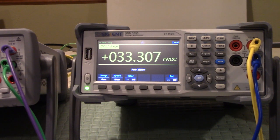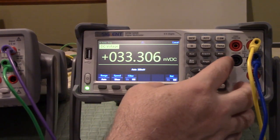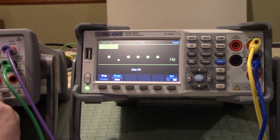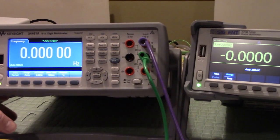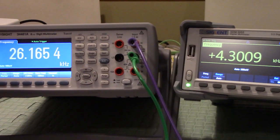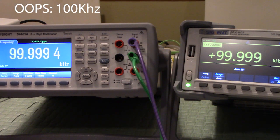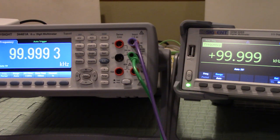The next test is the frequency test. I'm hooking this up to the Tektronix function generator set to 10 kilohertz, and both meters are reading the same — really, really good. Now the interesting part: I've done this before and it turns out that the Agilent here can only go up to about 800 kilohertz. So let's get up there — at 900 kilohertz the Agilent goes cuckoo. The Agilent's limit is around 830 kilohertz.